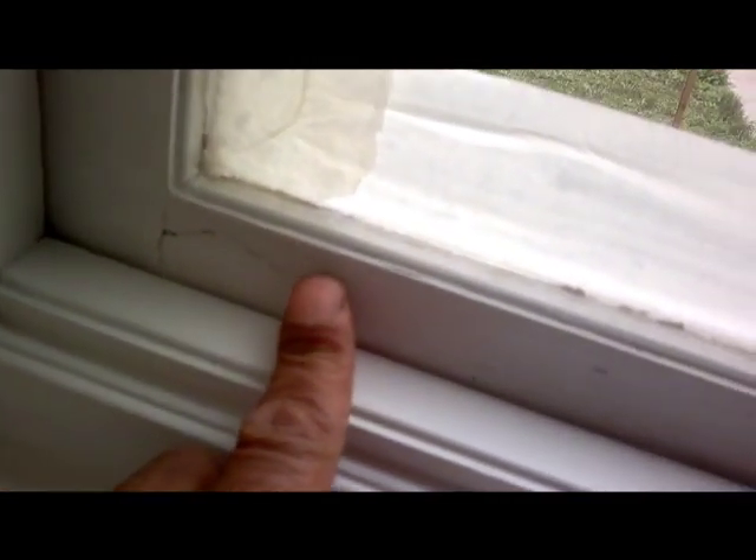See there — there's a big crack there. Feel it first. Some of these cracks, if they're not too massive, the paint will actually fill them. But on here you can see it's like a scab — get rid of it, otherwise it's going to be left in your work. Any holes you don't want, fill them up before you start.